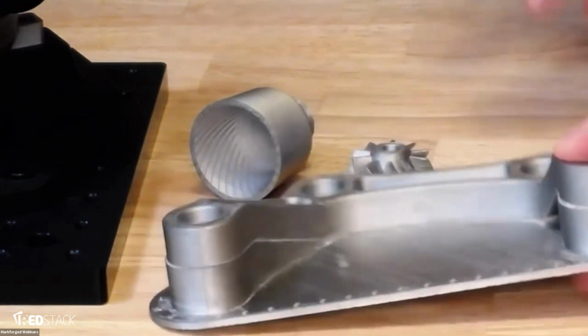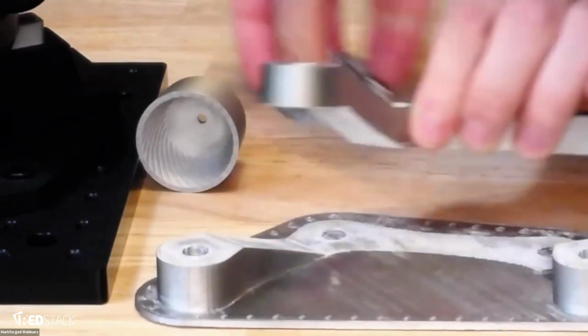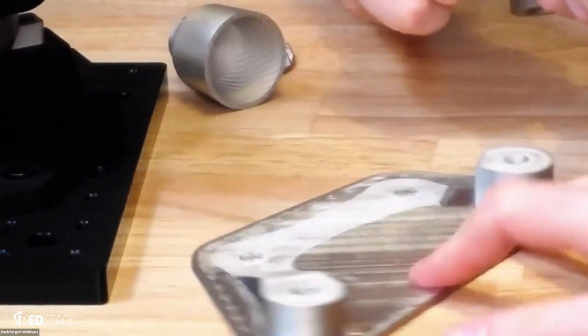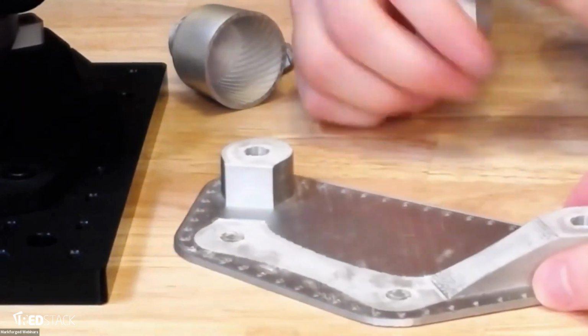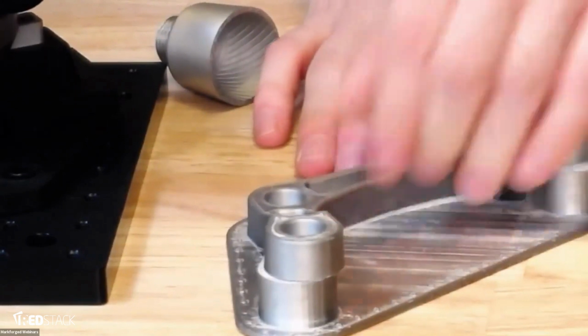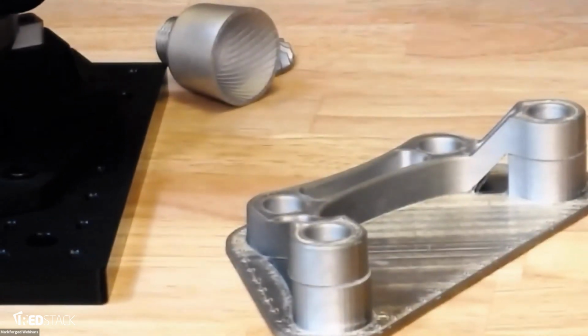The supports are like materials. This is also steel here. What is not here anymore is an interface layer. Normally on top of this raft and below this printed part, you would see a small ceramic release layer printed. As you sinter, that release layer turns from a filament to a dust, and you just break it apart after sintering. It's worth noting that chunkable supports and little things like that are still being ironed out.